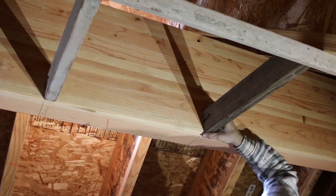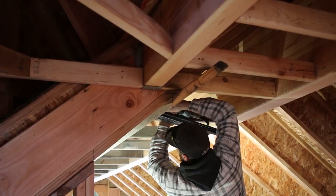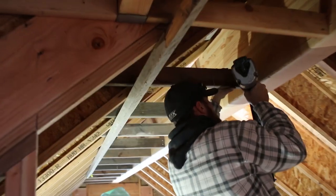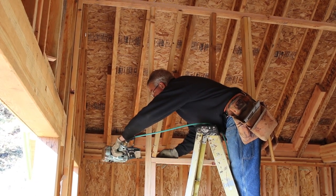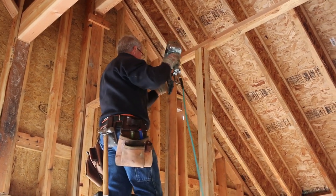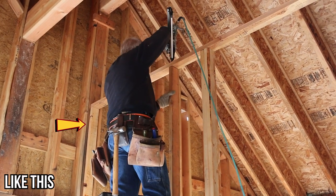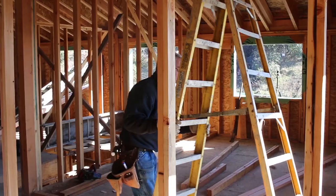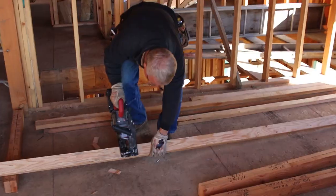I'm sure I've mentioned this before, but let me say it again. One of the things that you have to think about all the time while you're framing walls like this, particularly interior partitions, is how the drywall will install and fasten to the studs. Drywall, sheetrock, needs backing around every intersection. So when you're framing, you have to make sure that you leave lumber on each side of every corner for the drywall to fasten to.